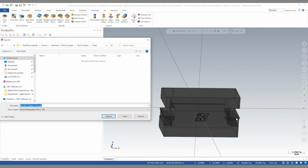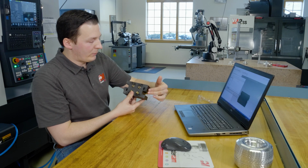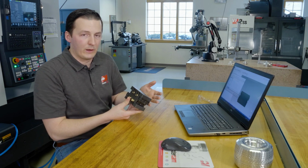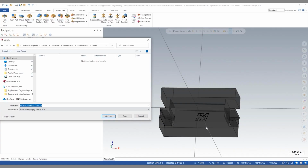Now it's important to notice this tool has four different configurations. We can flip these wedge blocks to top or bottom. Now each one of these combinations requires its own solid body because each solid body gets configured in a different way inside of our setup window. So this body is currently set up to have the inserts facing down. So I like to use the file naming standard, left insert down, or LID, and then RID for right insert down. We're gonna save this component like this,